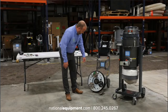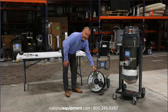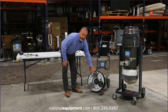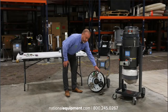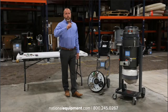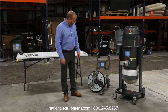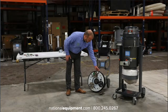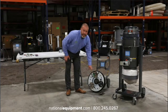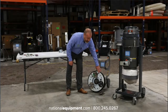And we can also look at, especially here on our Helix, and this is something that sets the Helix apart from a lot of our competitors, is that you have the ability to do a passive planetary grind as well as a direct grind. Some of the tools that we're going to talk about today require a specific direction. They have to spin in a certain way to work. So if we were to put these little carbide chips on our passive planetary heads, they wouldn't do anything. So I will talk about where to put them on, especially the Helix.